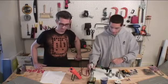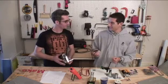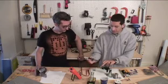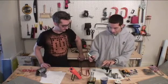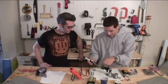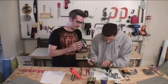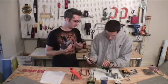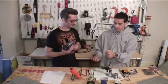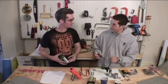Now the part's ready to go and we have our soldering iron. The main key to soldering is good heat distribution. You want the soldering iron to transfer heat to both the pad of the circuit board and the component lead. Touch both at the same time with your iron for about a second, make sure everything's nice and hot, and then apply your solder. A common mistake is putting a ball of solder onto the tip of the iron and then touching it to the lead — that doesn't do anything the right way.